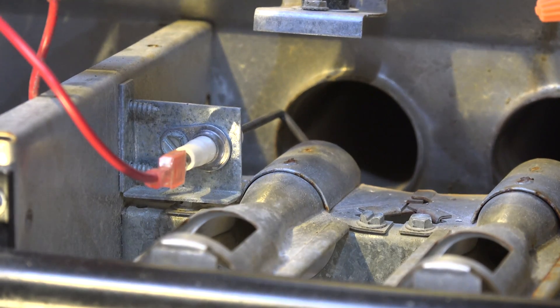This one has a flame rod. The reason the flame rod was put into this thing is because they had troubles with that hot surface igniter sensing flame — they were always a problem. They finally did away with them completely. The manufacturer put these aftermarket flame rods on these things because of the problems, and eventually they just eliminated using the hot surface igniter at all and went totally to the flame rod.